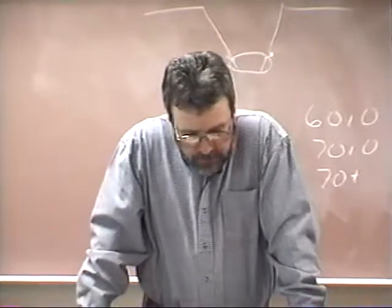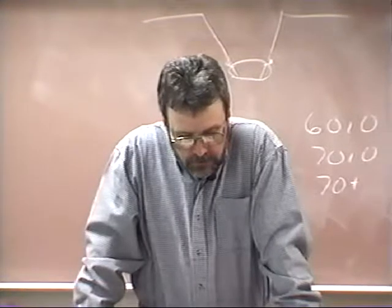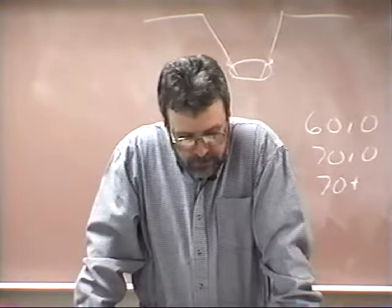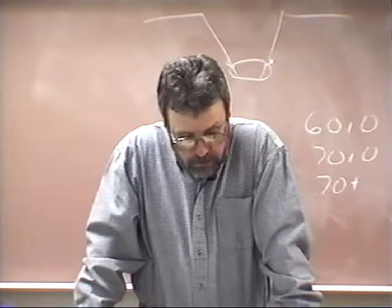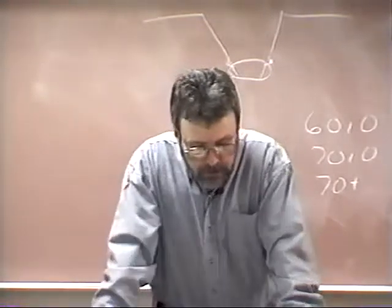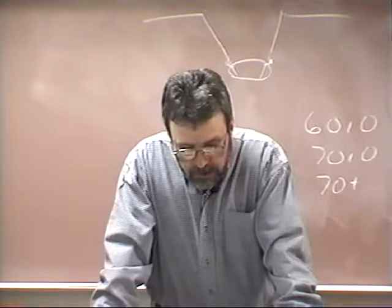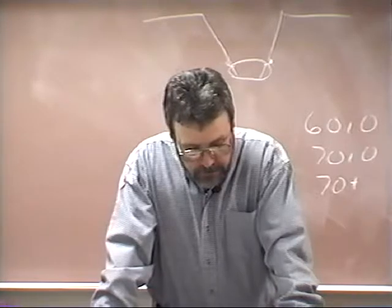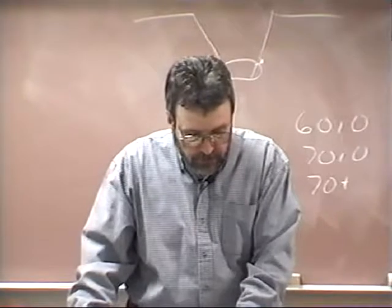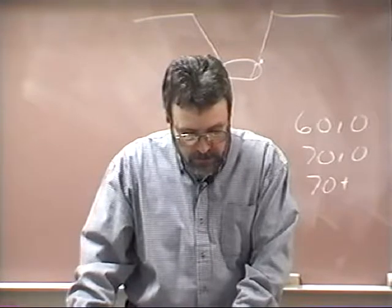118. The purpose of the up and down whipping motion is to control the weld puddle and to force some of the liquid metal to flow into the corner of the weld, thereby filling any undercut. To reduce the fluidity of the puddle and to prevent overflowing, the whipping motion should be about 1 1/2 electrode diameters long and made in the direction of welding without a change in the arc length. While whipping, the arc should be made to pause in order to deposit filler metal in the crater. The entire hot pass is deposited using the whipping procedure. As the bead is being deposited, the welder must maintain the correct electrode angle in all positions around the pipe.